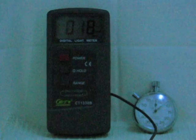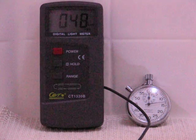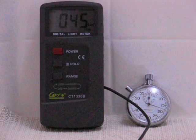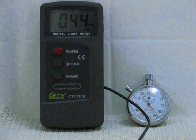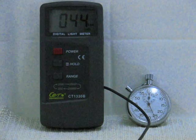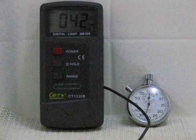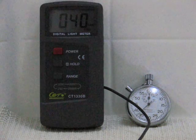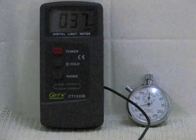Okay we're on. This will be a little bit slow to start. Now this light was designed to use four primaries, four CR-123s. I've been using the light regularly with four three-volt RCR-123s. Now those cells are not actually three volts fully charged — they're closer to about 3.5 volts. So I'm actually overdriving the light by about two volts, but it seems to be able to take that no problem.